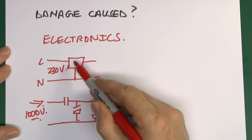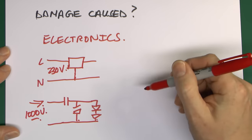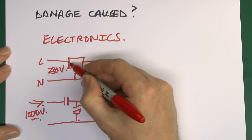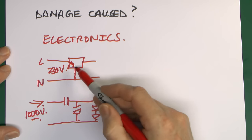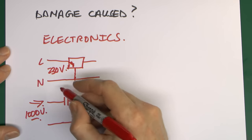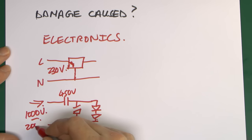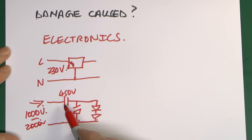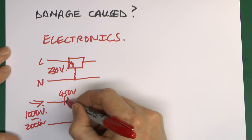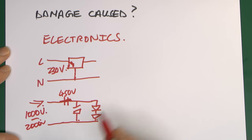If there's a current or voltage regulating device there and you shove a big pulse of very high voltage through it, even for a few microseconds, that can cause some kind of internal fault and it pretty much won't work anymore. If you've got capacitors across the line rated for, say, 450 volts, and you shove 1,000 or 2,000 volts in, it's fairly likely to fail — either fail open, in which case nothing works, or fail short circuit, in which case it's going to damage other things by allowing excessive current to flow.